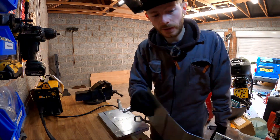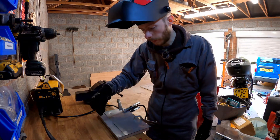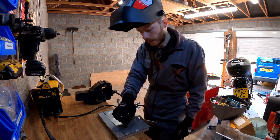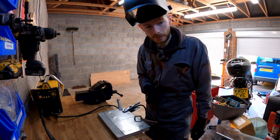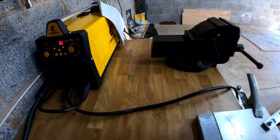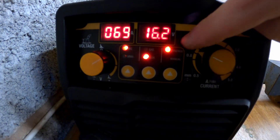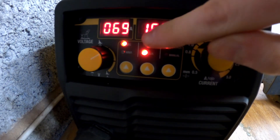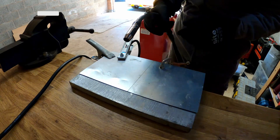The reason it's bent is because I was hitting it with a hammer to test its durability. This time I'm going to try a butt weld — I've got a big metal block and two bits of 1mm thick sheet metal butted together. I've got the welder set roughly on the 1mm thick setting in synergic mode, flux core on MIG. Those are the settings I'm going to use — might tweak it as I go along. Here goes nothing.